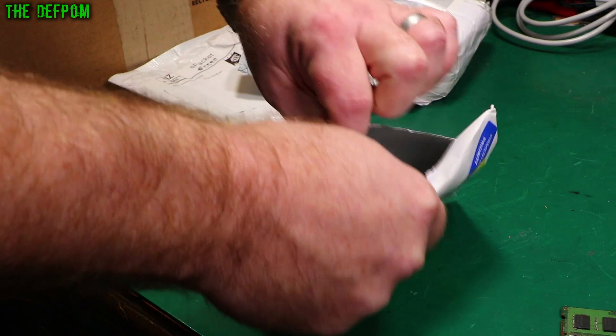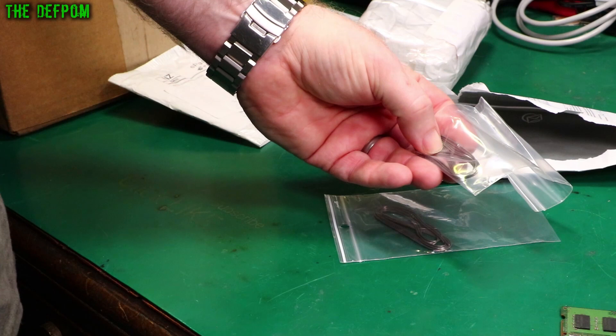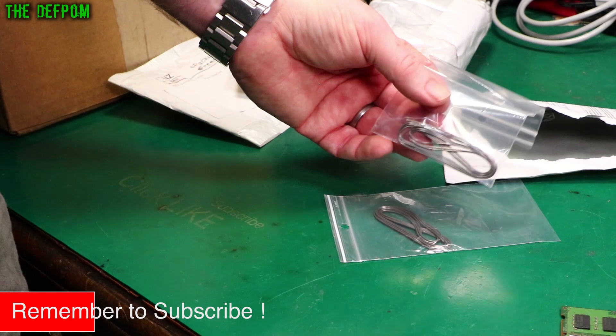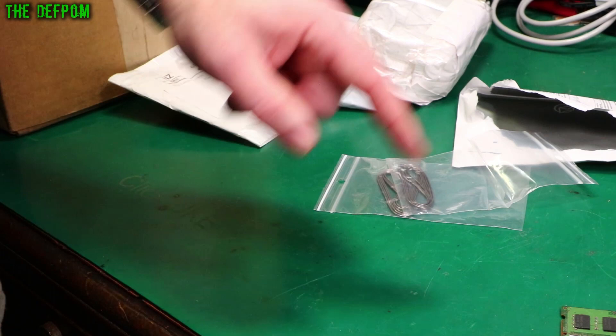This is supposed to be some low melting point solder. It's amazing how expensive this stuff is. I don't actually know if it really is low melting point or not — I guess I'll find out. Something I've always liked is having low melting point solder. The lowest stuff I've got is my lead solder, my standard tin-lead 60-40 mix. This is supposed to be low melt, without flux, by Kimit, at 124 degrees C. There's been times when I wanted to get a device off a board and it would have been nice to have some low melting point solder to help get it off without risking damage. Sometimes it just makes it a lot easier — flux it up, put some low melting point on, and off you go.